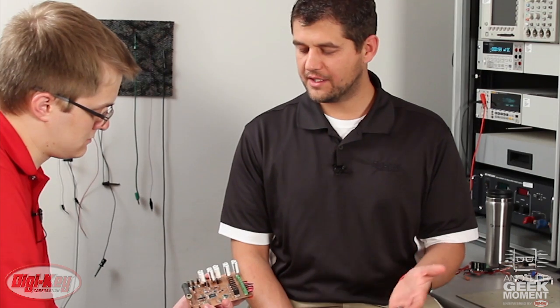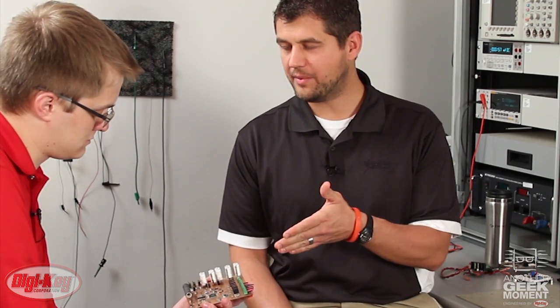What are you powering your system from? Two 12-volt lead-acid batteries in series. Let's do some quick math. The drop across your regulator is roughly 24 volts. You're pulling roughly an amp from it, so you're basically dissipating 24 watts as heat from your TO220 package with no heat sink on it. Is that bad? Well, how's your finger? Blistered.